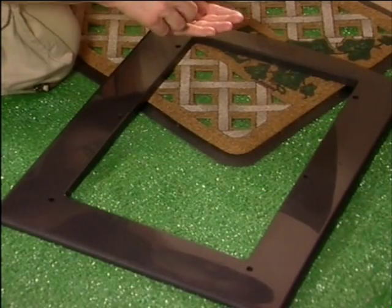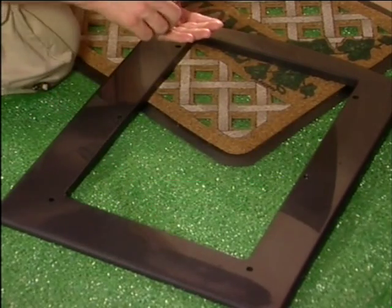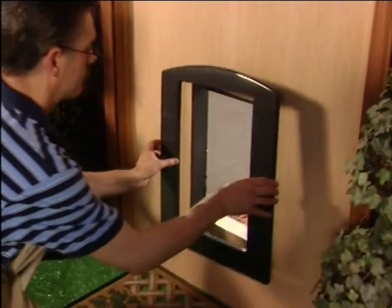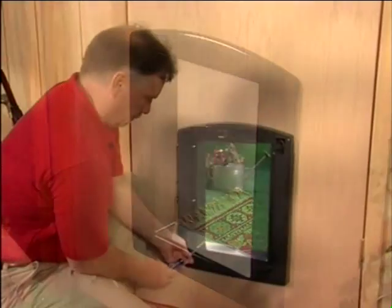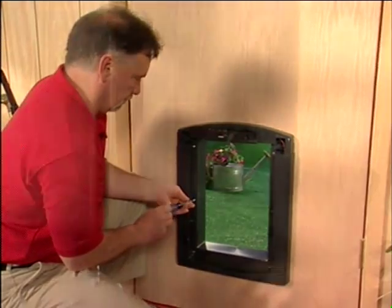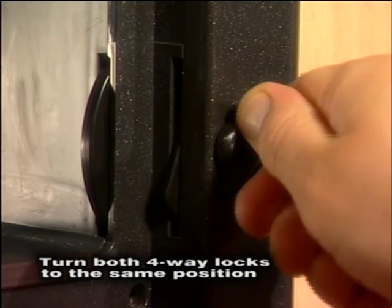From the outside of the door, insert the hexagonal nuts into the holes provided as far as they will go until they lock in the hexagonal housing. Once locked in position, line up the holes with the protruding bolts and attach the frame to the door. Tighten the bolts a little at a time until both frames become flush with the door. Be sure to experiment with this lock, making sure you understand each position.